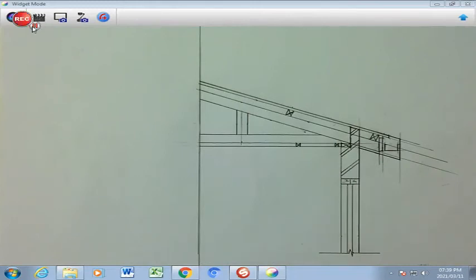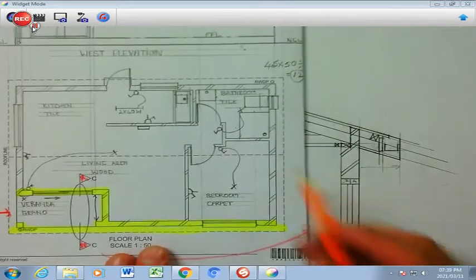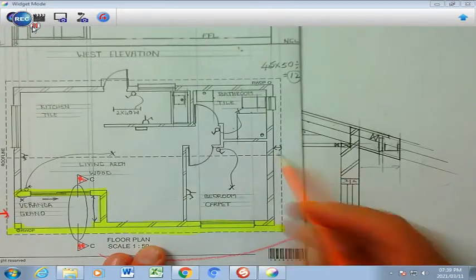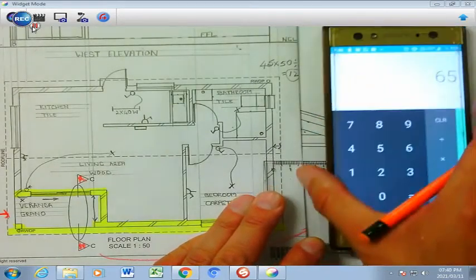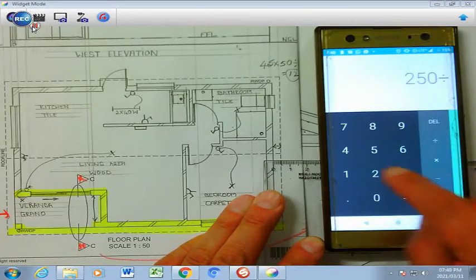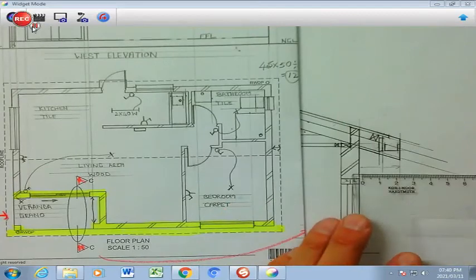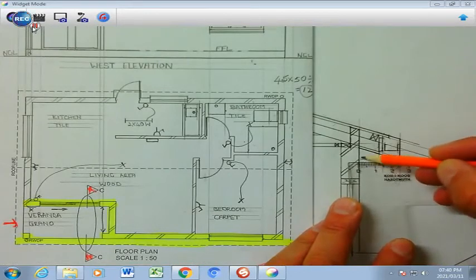Remember that process. Should they not give you the overhang, I would also suggest you measure the overhang. If they don't give it to you, you measure that — in this case it's going to give you 5 millimeters. You say 5 times 50, which scales it up, and then divide that by 20, giving you 12.5. Remember, we had 240 divided by 20, and that gave us the 12 space from here to there — your 12 that we saw there.